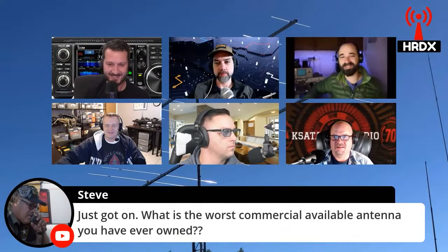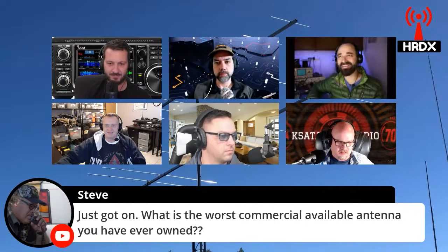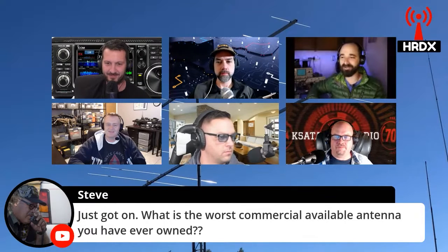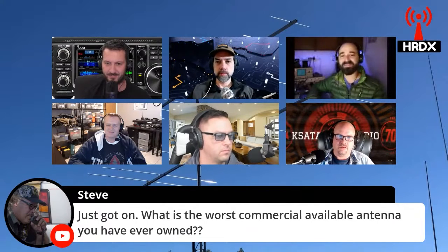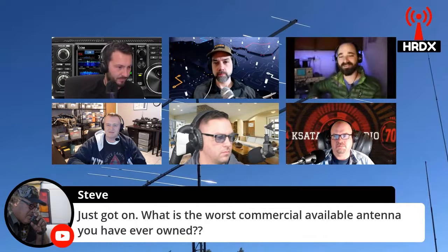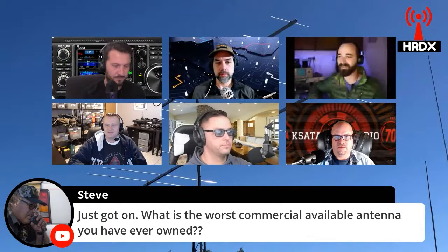I just put a link up to an antenna that came with my FT817 when I bought it used many years ago, and it's called a Miracle Whip antenna. It supposedly operates from 3.5 to 450 megahertz — so 80 meters to 70 centimeters — and it's got basically a variable inductor inside, an extremely inefficient variable inductor for the amount of loading it provides. I want to say it's a 50-inch telescoping whip.